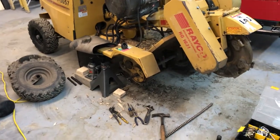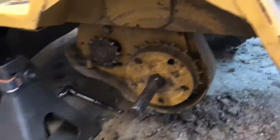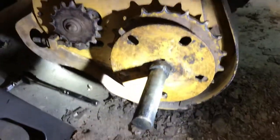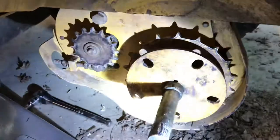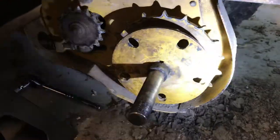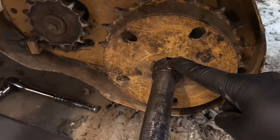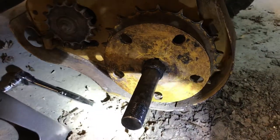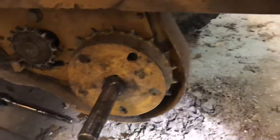The non-drive side would just slip, and one side would keep spinning, so it wouldn't climb the trailer or the chips — people were not able to mulch without pushing the unit forward. So I was trying to figure out what was going on. I took the drive motor side wheels off, and after I took the chain off, I noticed there is a small keyhole right there, and whether the old key sheared, broke, or wore down, it came out.